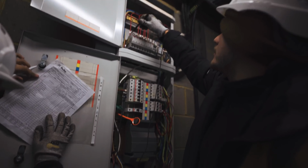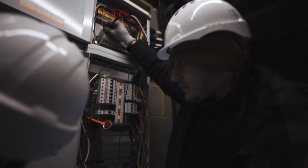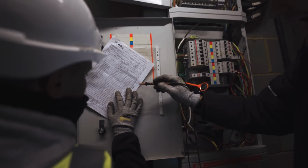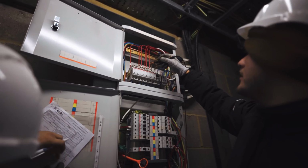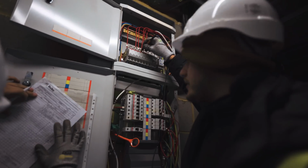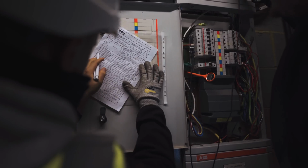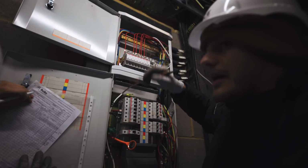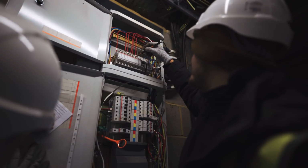Nothing there. Of course, the contactors. 0.05J. 0.5. Don't worry about putting 1R because we know that from there, basically. So just put it next to it. Do a slash and then write whatever result I tell you. Hang on. R2 is clear. So just put greater than, just put clear. Y2, which should just be below it, 2Y, it's clear. B2 or 2B is 0.012. Put a large M after all of them as well, mate. What, even on the clear ones? Not on the clear ones, sorry, yeah, just on the results, mate.